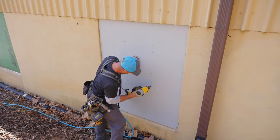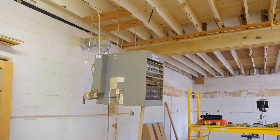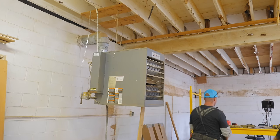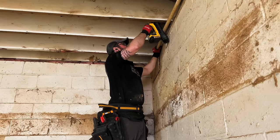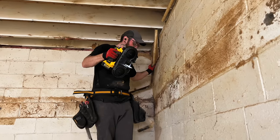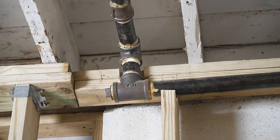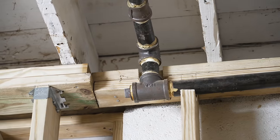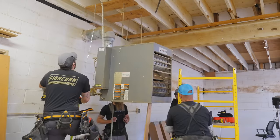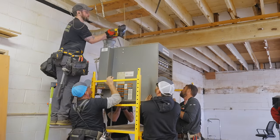The other big thing that needed to be removed was the natural gas heater and the gas line running to it, which was directly in the way of where we needed to frame the walls. We had an HVAC company come to shut off the gas, then broke down the gas line into more manageable chunks with a portaband. The HVAC technician capped off the line, turned the gas back on, and checked for leaks — there weren't any. Once the gas line was dealt with, we cut the heater free of the threaded rod it was hanging from and dropped it onto some scaffolding to keep it mobile.